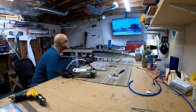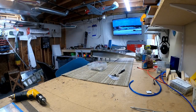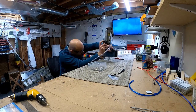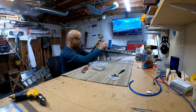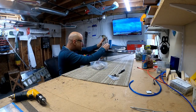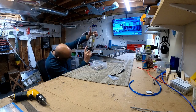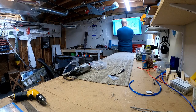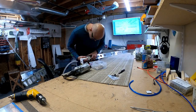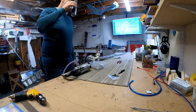These specific skins fit very, very tight — and I do mean very tight. I had to use a little pin or cleco or something to sort of push the skin and stretch it just a little bit to get those rivets to sit in their holes. But it worked out pretty well.